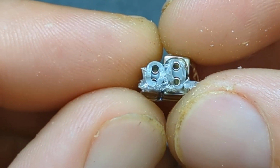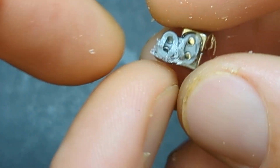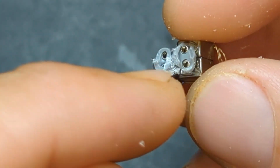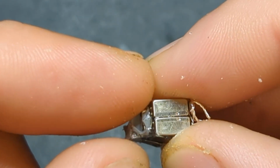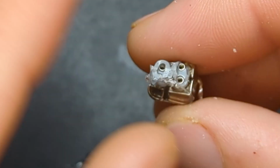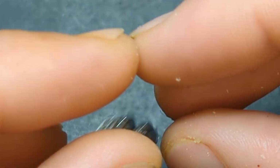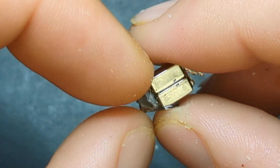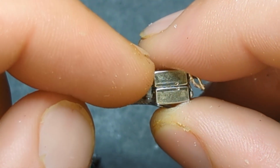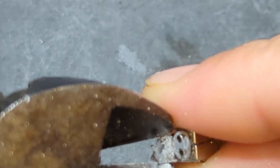Okay, so there you can have a better look at it. Traditionally you would have a tube, and you would have to stretch the end of the tube out so it fits over both BAs, and then you'd have to add resin to fill in the gaps. But in this case, they can just print these little things and go bloop, stick them right over the balanced armatures, and it makes assembly way easier, and the positioning stays the same. When you're stretching a tube, if you don't stretch it properly, it can have different issues where it's kind of angled, like the balanced armatures can face a little down or a little up, or one side can get a little more impeded than the other. There's various things. For the most part, the tubing is pretty forgiving, but it's not as symmetrical as a print.